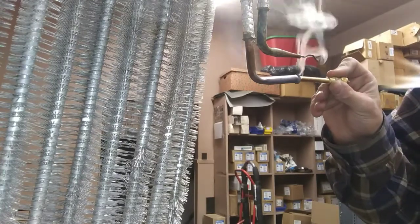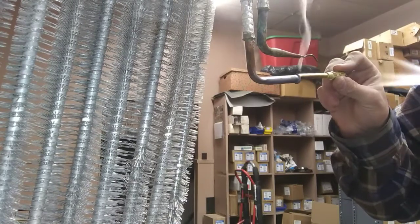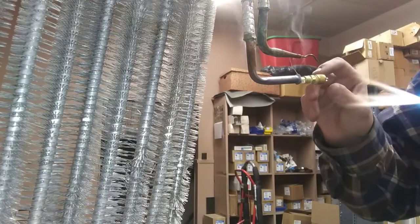This is a very old set of torches, so it can be a little bit finicky. When you're lighting this, the blue part is going to be the hottest part of your flame, and you want to touch that to the joint. I don't really think that's hot enough — turn that up. All I'm trying to do is melt that solder right there so I can pull this out. There it comes. Now I'm going to stick my Schrader port in — stick it in pretty good ways — and we're going to braze this up.